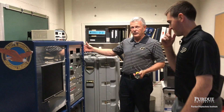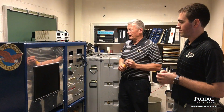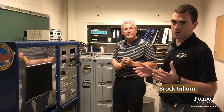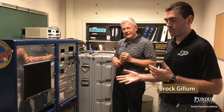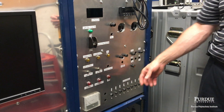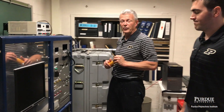This is the old control that was actually wired in. Brock had several hours just sorting through those old harnesses and figuring out what we could extract and use toward that shoebox. We still wanted to make sure all the parameters were the same and the wires that were labeled were still what they said they were. In the end, there was still a lot of rewiring that had to be done. We would actually stand here and have to hold these control switches in order to get the engine to set up and actually start and perform the way we wanted.